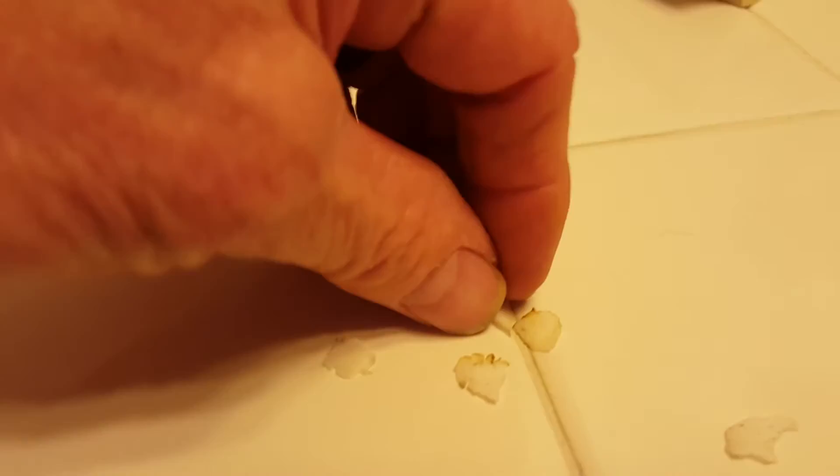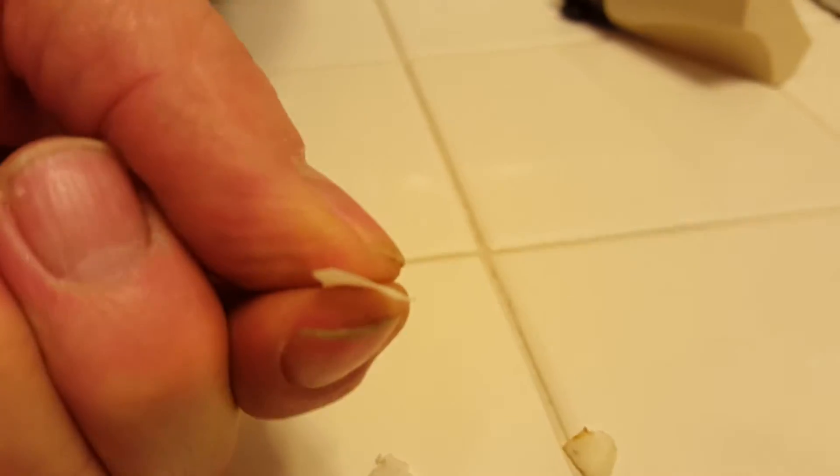And here is some of that debris. We're not sure what it is — it is hard plastic, it is very thin. The only thing that we can think of at this point is there are some tubes, heat trap tubing in the water heater — Bradford White. They have these heat tubes that stick down into the tank, and that's the only thing we can think of since it was only on the hot side of the valve.